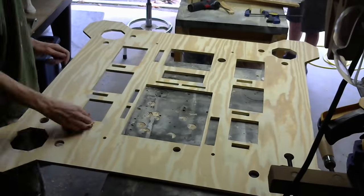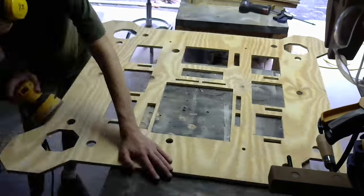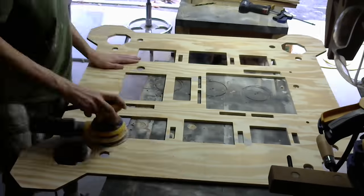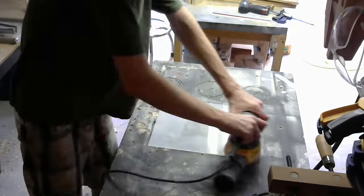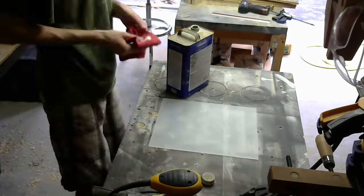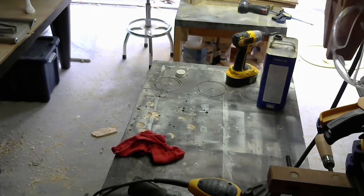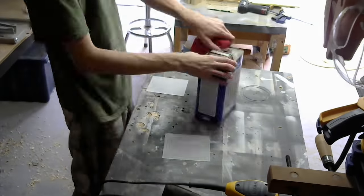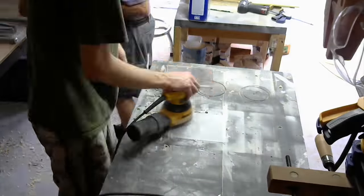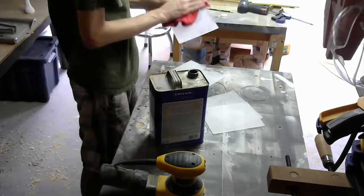Also, during this time, my grandfather was busy measuring and cutting out the acrylic plexiglass panels that would be mounted behind the components. After all the sanding of the frame, the plexiglass panels were all cut. So, in order to achieve the frosted white color that we were talking about before, I just went ahead and sanded the acrylic down with the circular sander. Sanding down clear acrylic roughens the surface, creating a faded white, which disperses light evenly across it.